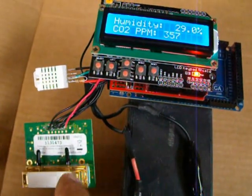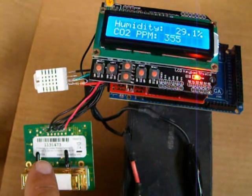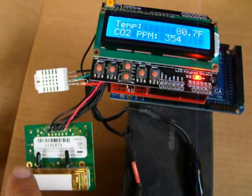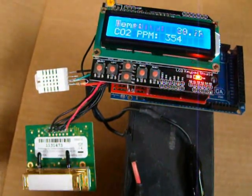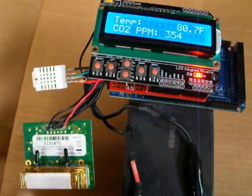I had to watch it on the oscilloscope to watch the acknowledge line, the request line, the clock, data in and data out lines, just to get the timing, to figure out what they were doing and to figure out what the data packets look like.